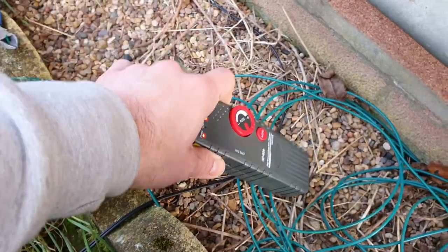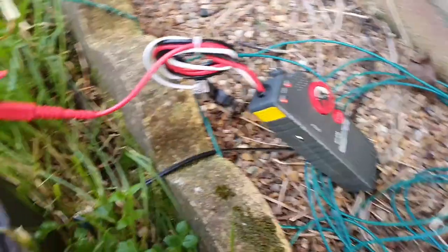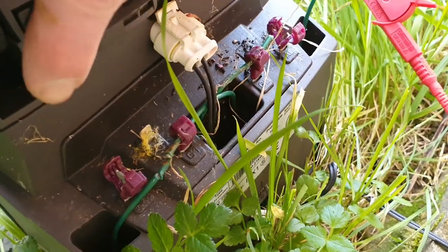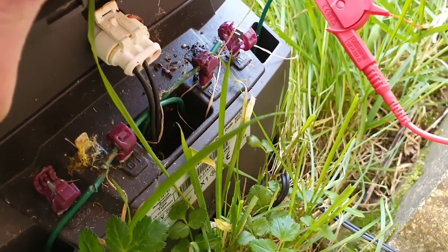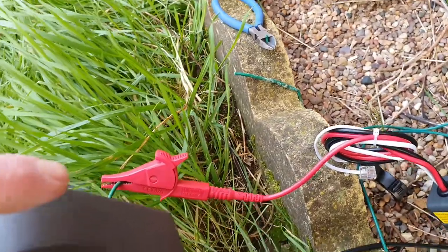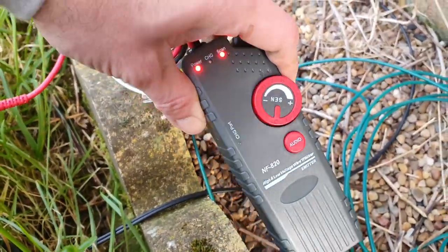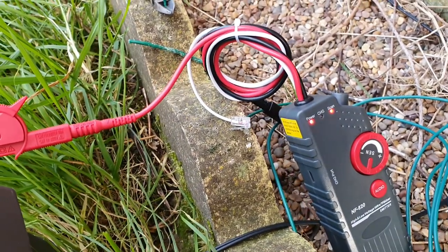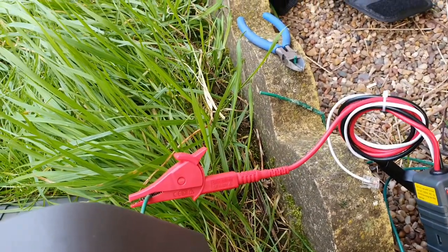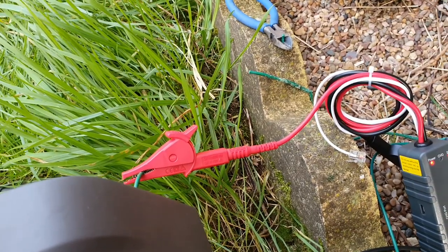This equipment apparently works to find both AC two-wire and also single-wire cables. It works by having a detection unit. What I've done is disconnected both ends of the loop from the base station, connected just one end to the crocodile clips from the emitter unit, and then turned up the sensitivity quite high. It's then just a question of following round with the receiver unit.